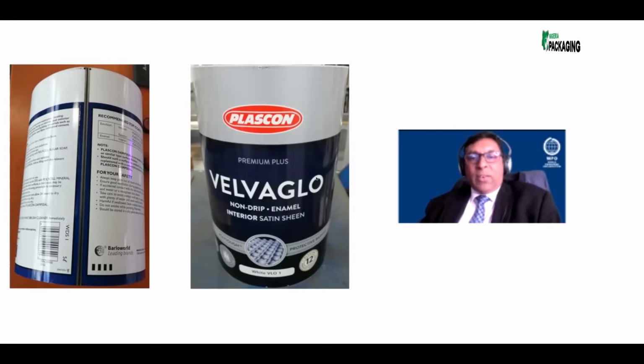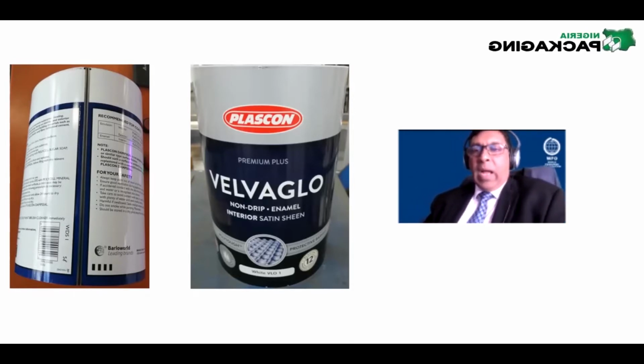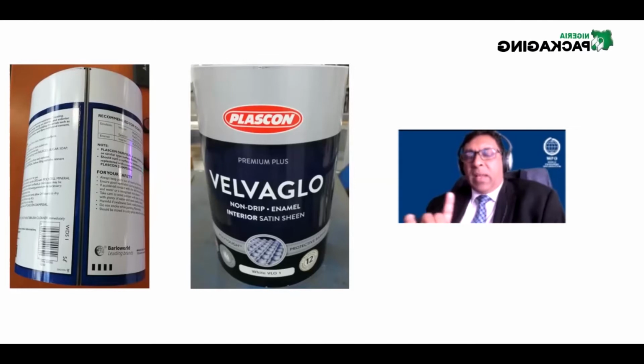What we then do is we have a can like this, which is now round and it's welded on the side. This is where we protect the weld, both on the inside of the can and on the outside. We protect it with a spray, which typically could be an epoxy phenolic spray. And this spray will then protect the weld from attack from water or humidity. So this is how the can looks.